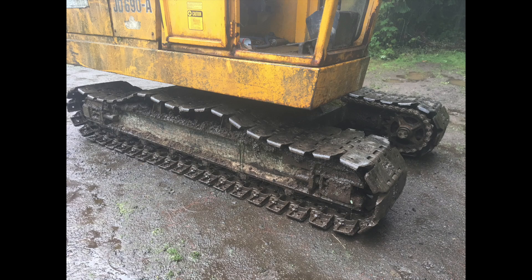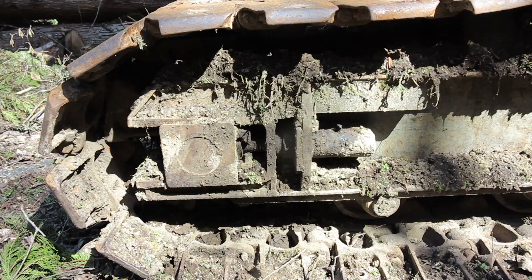I really do need to tighten these tracks. I've been soaking the adjusters with a 50/50 mixture of ATF automatic transmission fluid and acetone — maybe this weekend we'll see if they'll loosen up enough. We might have to put a little heat to them, but hopefully I can get these tracks tensioned correctly and won't have to split the track and put it back on again. Hope you liked the video — if you did, please like, subscribe, and comment down below if you have any questions.